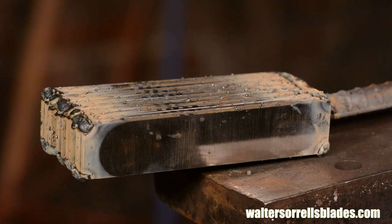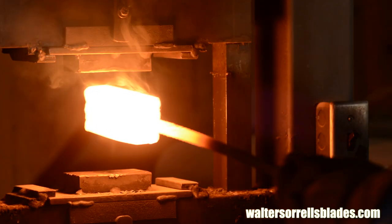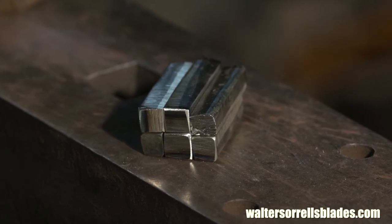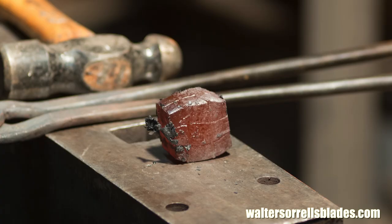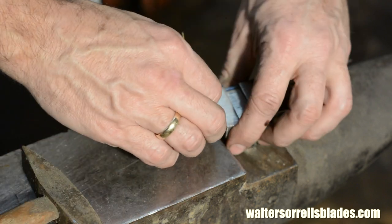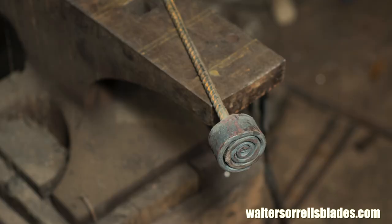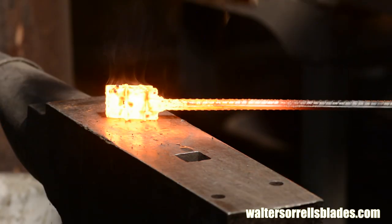Second element: how the steel is initially stacked. Most modern Damascus is based on stacking flat bars of steel and forge welding them together, but that's not the only way to make Damascus. Stacking square bars was common in the firearms industry back in the 19th century and even earlier. You can make checkerboard patterns, you can spell out letters like an old-fashioned dot matrix printer. You can twist round bars together — that's what the Vikings did. You can weld chainsaw blades and elevator cable, or stick stuff into a can and squash it all together. Each initial configuration affects the final appearance of the steel.